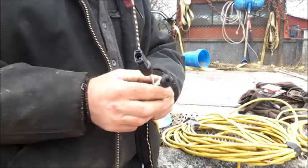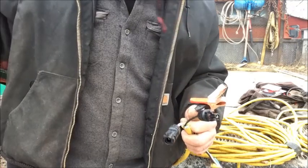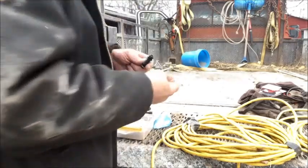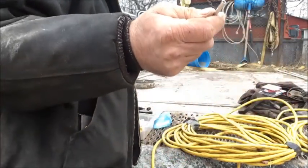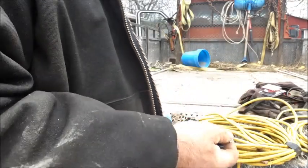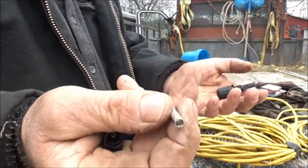I've got my connectors on the extension cord. On the other end, I've got a couple of mini clamps to go onto the battery cables. This way I can run it all the way over to the north side of the barn where my tractors are parked. These connectors basically come apart like this — they've got a little weather-tight grommet here. You put this on the wire, strip your wire, put it in there, and then this will insert into the base. This is actually for the positive lead — there is a positive and a negative, and you've got to keep track of that.